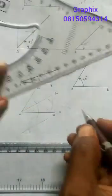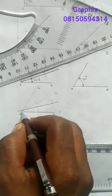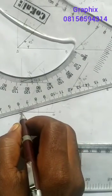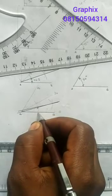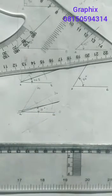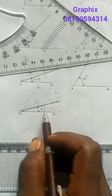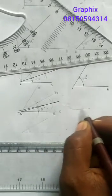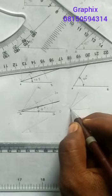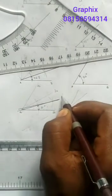I will now join those two points to the center here. It should be touching the base at this point here. The angle in between here and here is 15 degrees. So if you continue further, you bisect 15 to get 7.5. That means from your baseline you get 60, then 30, then 15, and then 7.5 and so on. Don't forget — this is the zero and this is the angle 15.